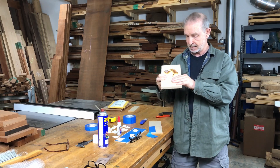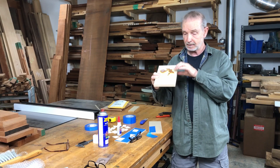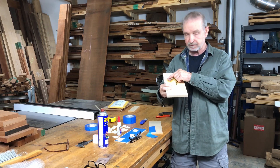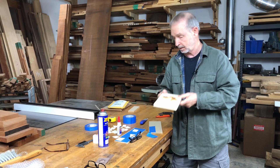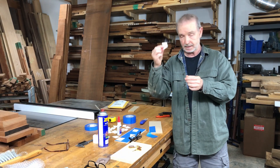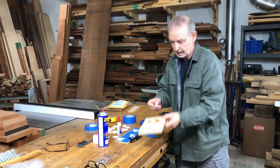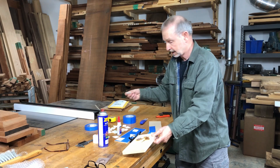The flower looks like this. The flower area, the leaves, and the stems are all going to be cut out of wood. He'll fit that in there, and then he'll delicately carve to give three-dimensional quality, and it'll sit above the surface. What Reed needed help on is the actual flower bloom area. What he wants to do is make this out of Mother of Pearl. I have a big collection here — it comes from a guitar-making supplier and it's about 60 thousandths of an inch thick. When done, it'll sit about 20 to 30 thousandths of an inch above the surface. It looks really beautiful.